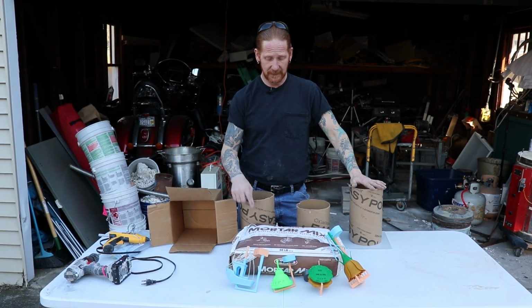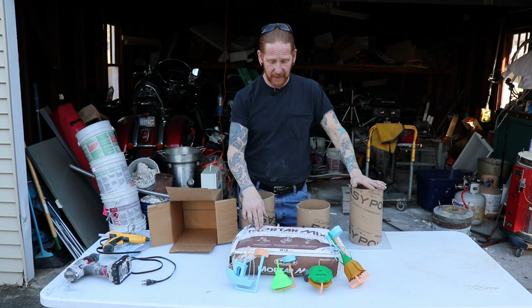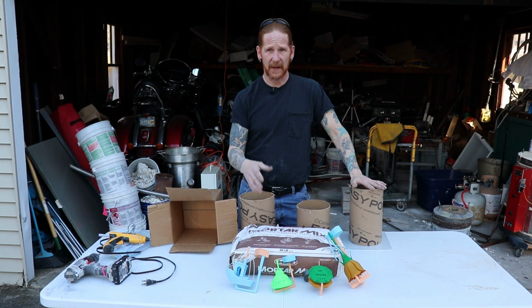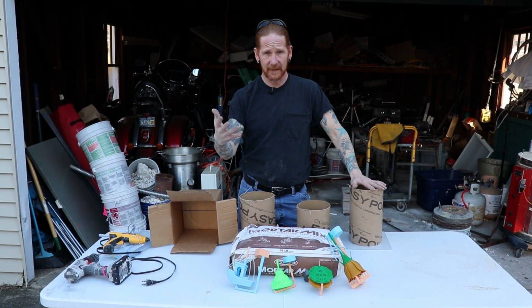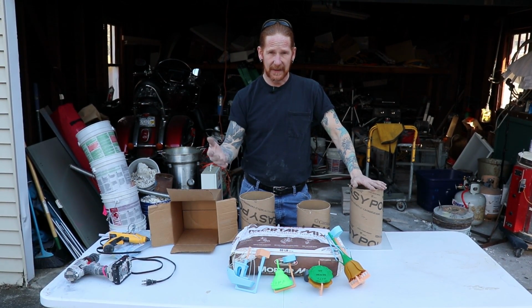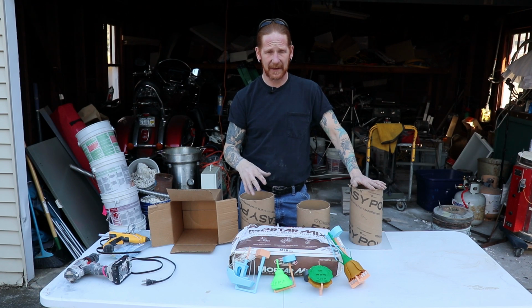That being said, a couple of suggestions and a little bit of the research that I've done: people have made some mold material out of mortar mix. The cost of this 55-pound bag of mortar mix was $16, so I'm getting a little bit more than twice the amount for less than what the plaster costs for half the amount. Now, I have been mixing it at about 50% ish, a mixture between sand and the Plaster of Paris.